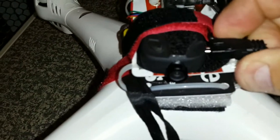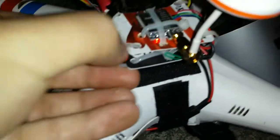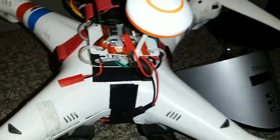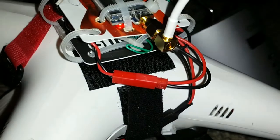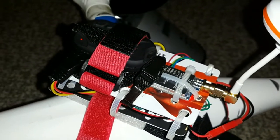The USB simply connects to the side. The 808 number 18 camera does have AV out, which makes it beautiful for FPV flying. You can actually power the 808 directly from the VTX because this one has got the 5V out. I generally fly it with the camera's own battery to keep the power clean, but as it's connected now it's actually powered from the 5V out of the video transmitter. You'll see a little red indicator light on the 808 camera showing that it's drawing power from the video transmitter.